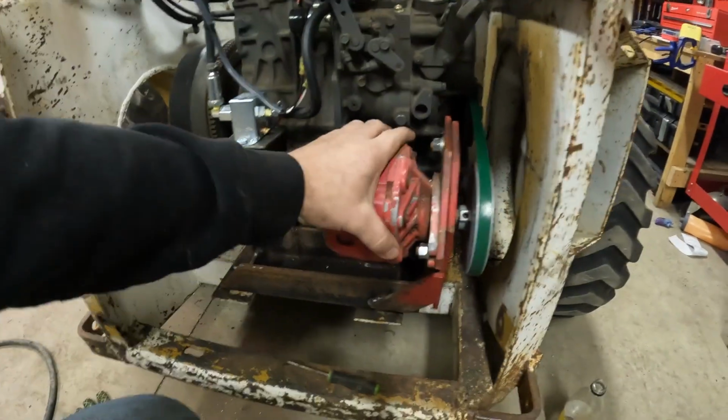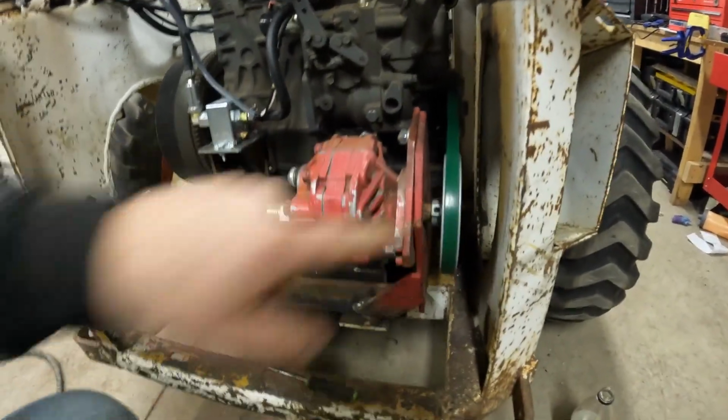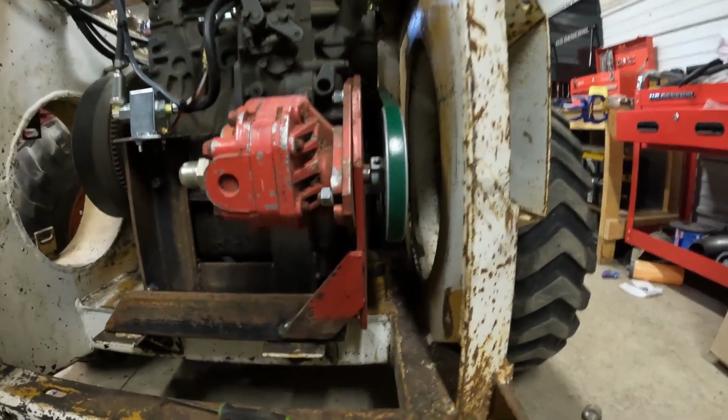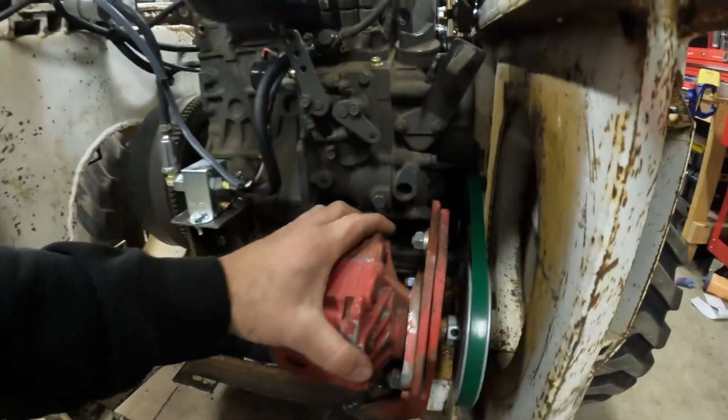All right, got my hoses, and I did pop the pump off and finished welding it up. So that's on there solid. Got our new pulley on. Appears to be pretty straight. So we'll see. The one thing is, right down there by the oil pan, we have minimal clearance. I can see light through it, so hopefully she doesn't burn that off there. But once we get her going and fire up, we'll have to see what it looks like.